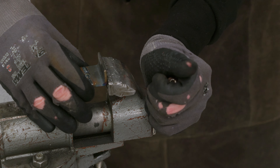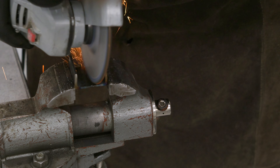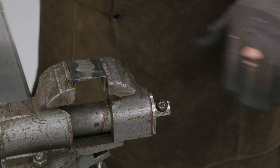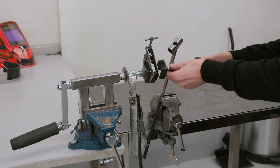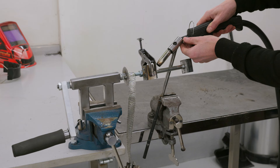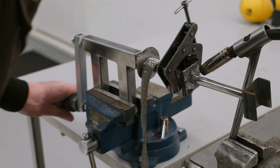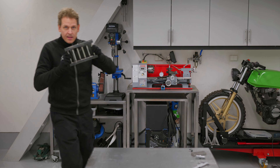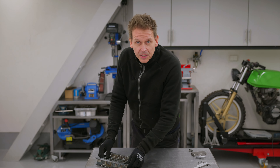The welding wasn't that important for these pieces because I need to grind them down. I don't want metal against metal for the gliders, so I have 3D printed these inserts. I need to grind away the weld before mounting them. Here I also have to grind down the weld to put on the rod in between. Note to self: don't wear a welding helmet when doing overhead shots. The final step is to use my welding positioner — I made it myself, a DIY project, making it easier to weld around a rod. And the gliders are done. Isn't the weld pretty nice? It does help to do some practice with your welder to get better.